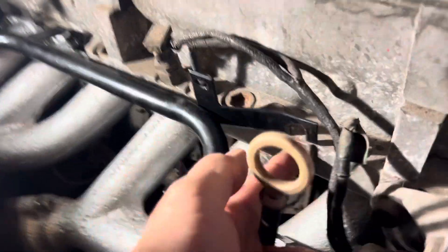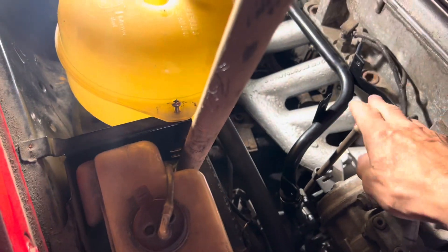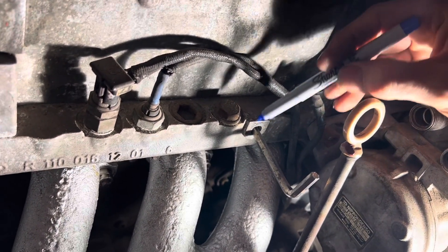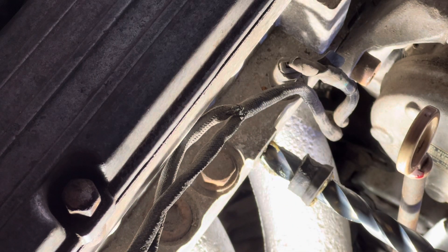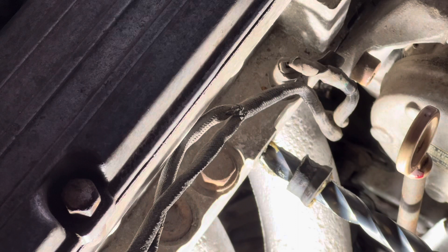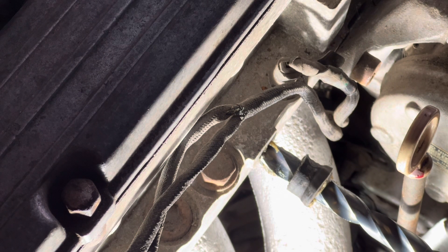These jobs sound so much easier than they actually are. First of all, we need to drill a pilot hole and then wind the insert in. There's not an awful lot of space — we need to make sure we don't damage the oil dipstick and will probably need to take off these containers and this metal pipe as well, to give us enough room to get a drill in there. We're just going to ascertain how deep that hole is and make sure it can take the threaded insert. We've slathered the end of the drill bit in grease to catch any swarf, and we've put a little guide on — just a bit of rubber pipe — to let us know how far to drill. It's not absolutely critical that the hole is perfectly perpendicular, as a deep hole like that will normally drag the drill bit perpendicular anyway.